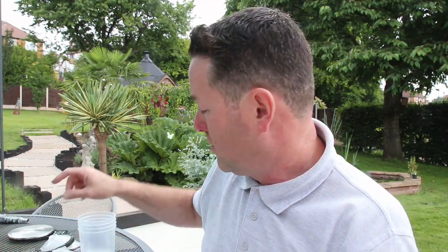where you've got cellulose thinners to flush it through, pumping it through, what I would do is probably use one of these back in the cup, put it back onto the top of the gun, fill it with water, warm water, not too hot, and flush it through. So flush the air cap through with the water, rinse it under a tap, swipe the needle, and that's a quick change, swap over to another needle, air cap, sorry.